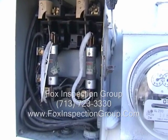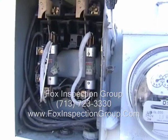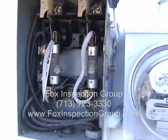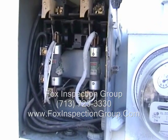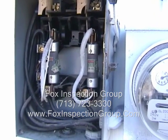What I'm looking at are two 100 amp fuses along with some bypass Romex, appears to be 10 gauge — rated for 30 amps. Three of those, so we're rated for an extra 90 amps. They probably had a problem with their fuses blowing, so they jumpered them.